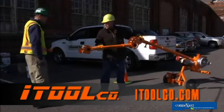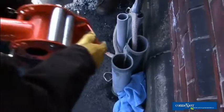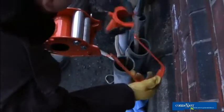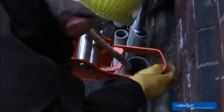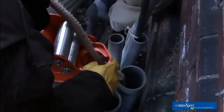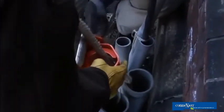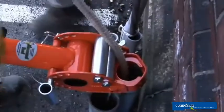We're going to go over to our conduit. Okay, Dave, we're going to walk this into place. Turn the thumb screw. That's it. We're going to slide out the universal adapter, set it in, and go around the root. We're going to set in the 3-inch conduit adapter. Tighten the thumb screw. Drop this into the conduit, and we're ready for a pull.